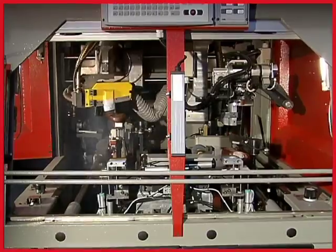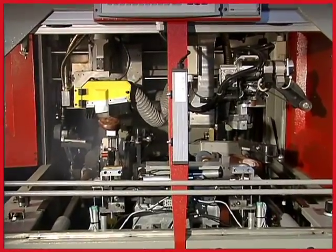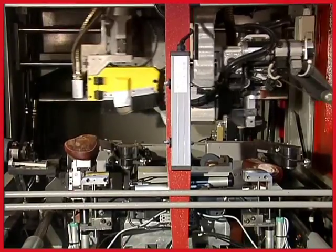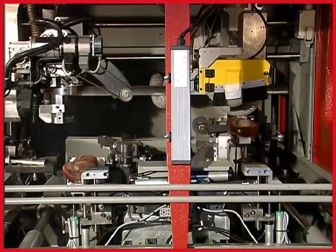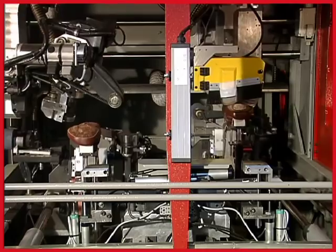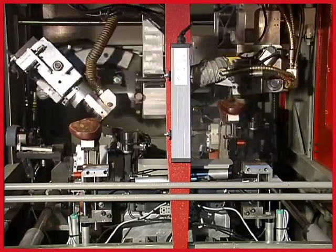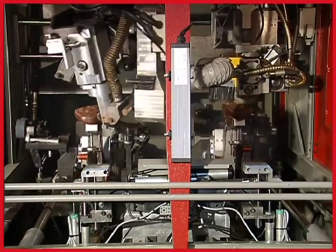After lasting, the shoes are loaded onto the machine. The first procedure is roughing the bottom. The CD8 then replaces the tool mount and begins to rough the side margin. At the same time, a new bottom roughing cycle starts on the other station.